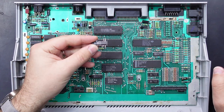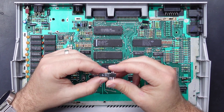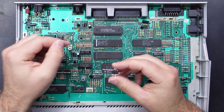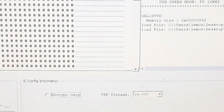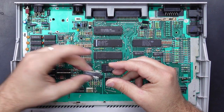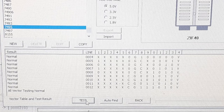The other thing to do is to program the GAL. I'll link in the description the file that I used to program it. This mod was done by Jurgen, who seems to be pretty popular among the Atari forums. One thing I noticed when programming this chip was that the MiniPro software wanted to encrypt the chip after it programmed it, and I had to disable that option so I could verify that the chip was programmed correctly afterwards. I also took the time to make sure the LS95 was actually functioning.